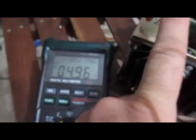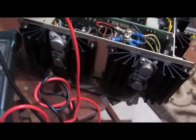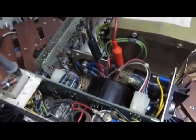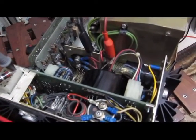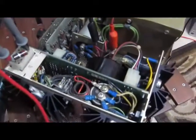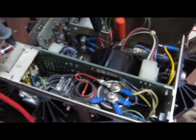Well, the power supply seems to be working — it's not quite back together. Unfortunately, a couple of the capacitors were shorted, which took out another transistor, and that's not something that I have laying around. I'm going to have to order up the right one. I've just got one patched in here for now just to try it out, but it does seem to work okay. I've just got a small load on here for now, but at least it seems to be in regulation.